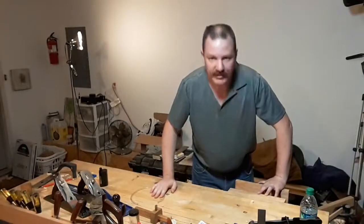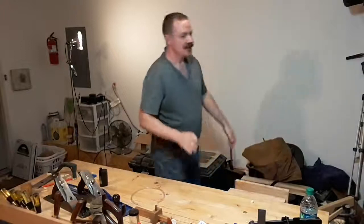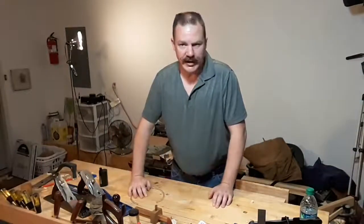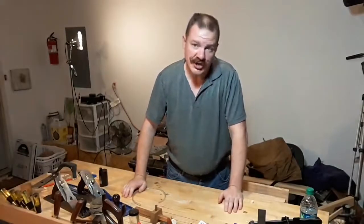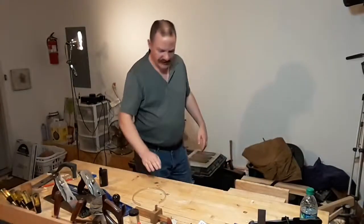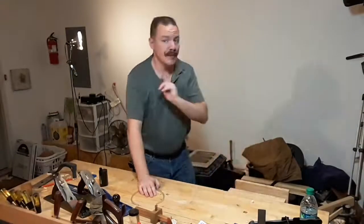And that thing we're making is a spice rack. At least that's the goal. So far, we've planed and dimensioned the two upright vertical walls of it. We've planed and dimensioned six of the shelves that we're going to be using. And we've surfaced and jointed, face planed and jointed the tops and bottoms, but we still need to rip those and dimension those to thickness.